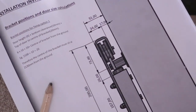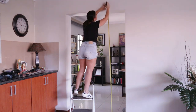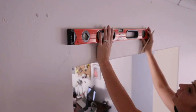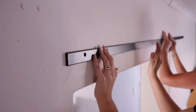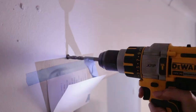Everything is here and it also comes with instructions. I made notes of the measurements they give you for full installation of this door. Here I am taking those measurements to the wall and the entryway, making sure I'm making all the right markings. I use a level to make sure everything is straight before I draw my pencil markings, lining up the rail so the pencil line goes through the center of each drill hole, with the help of my mum to make sure everything is straight.